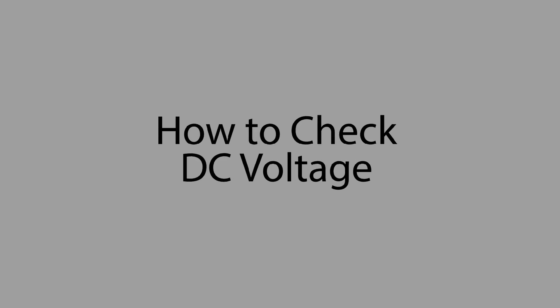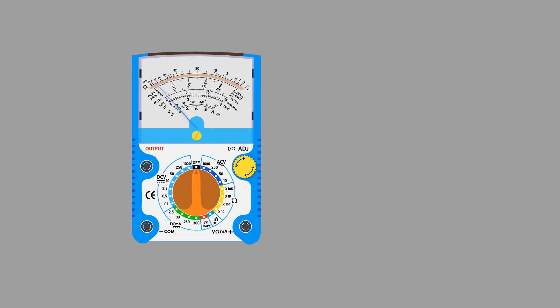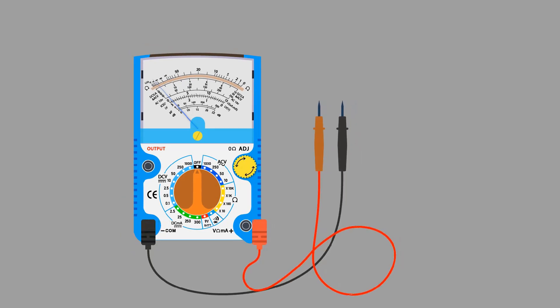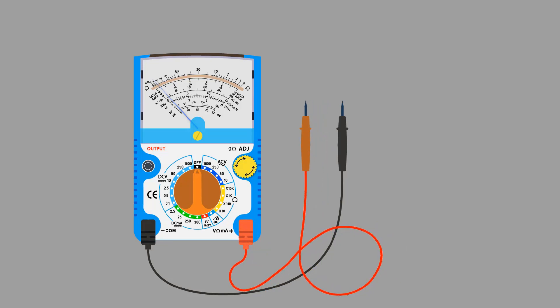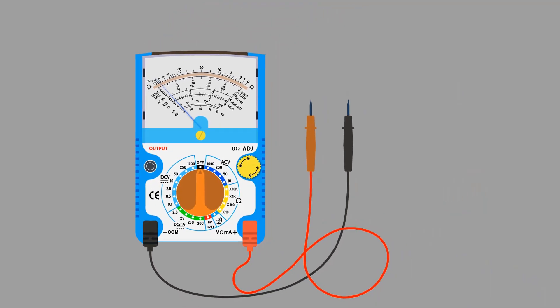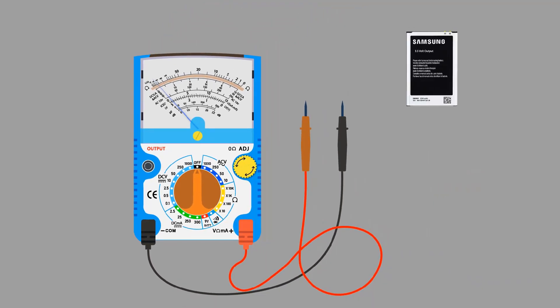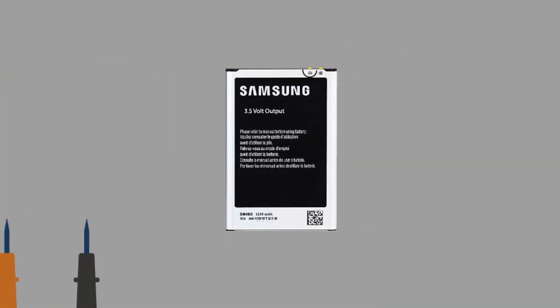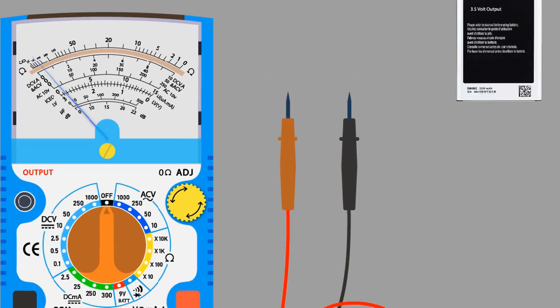How to check DC voltage. We have a multimeter to measure DC voltage. Connect the black probe of the multimeter with the common port and the red probe with the positive port. The blinking line shows the DC voltage section and the arrow shows the DC volt range which we can measure. I am taking a phone battery to measure DC voltage. The positive terminal and the negative terminal are identified — it's a 3.5 volt battery, so we need to select the 10 volt range.